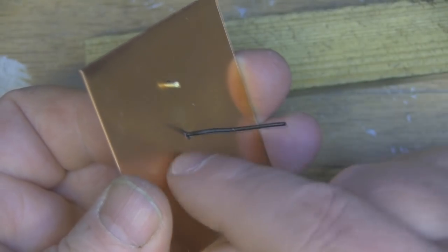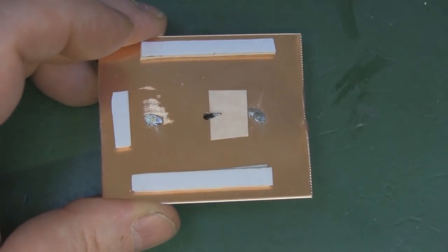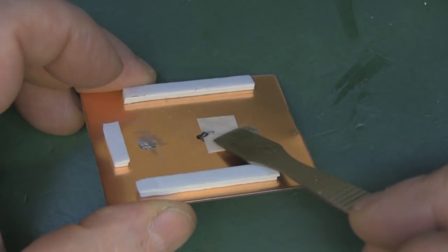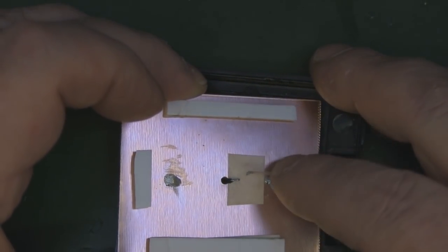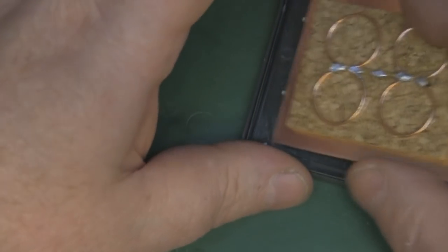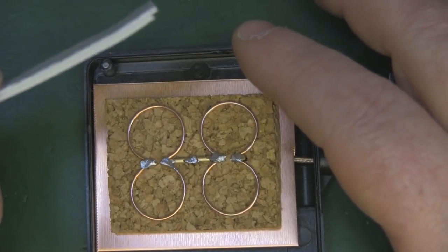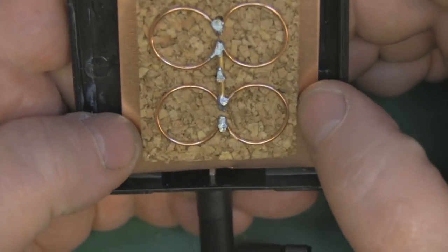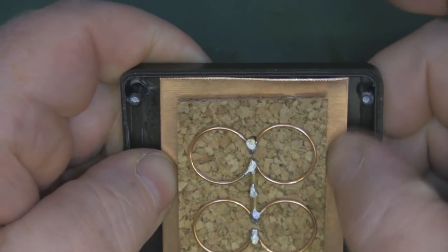The centre core needs to be insulated, otherwise it'll ground out to the back reflector. I've got the antenna ready to connect into the case and solder onto the coax. I've put some masking tape there just to make doubly sure we don't ground out onto the back reflector, and I've trimmed and pre-tinned that wire. The outside of the coax solders down to the ground legs, and the centre core solders to the insulated wire. I've also put double-sided foam tape on the back - doubled up to make it a bit thicker - to stick it onto the inside of the case.